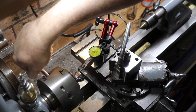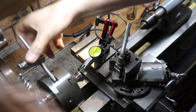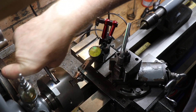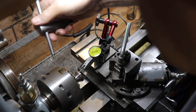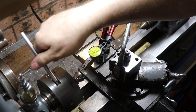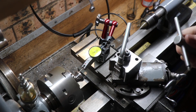Three is low here — loosen off number three, tighten up number two. What that's doing is moving the connection to the spindle. We're now down to 10 hundredths. Loosen the low side, tighten the high side. Really close now — we're down to three.